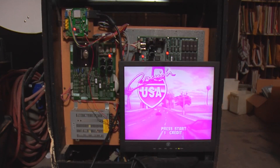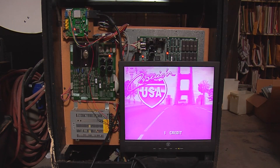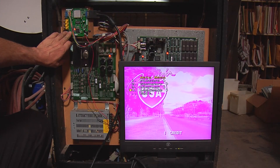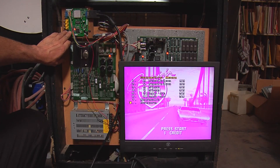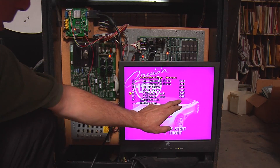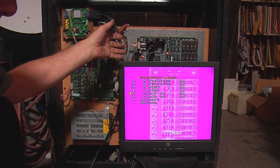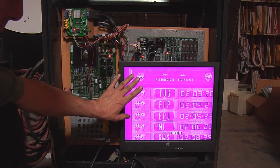So I'm going to show you how to adjust the clamp settings. It's in the geometry part of the menu. Here's our geometry — go down and you have clamp ST and clamp SP. These numbers from the factory come at 90 and 95, which seems to work fine on the 15.7 kHz low res mode, but when you get to this medium res, this happens here.